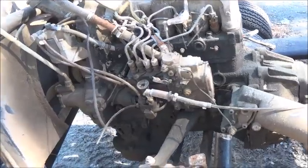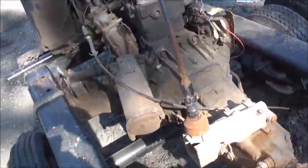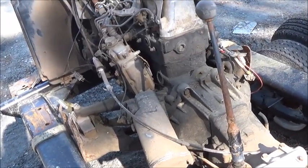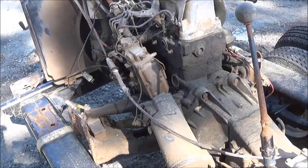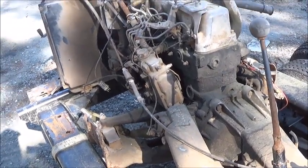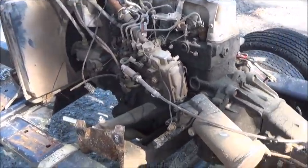We're going to find a used one because you need a governor — when you get into a load and it starts drawing the engine down, you've got to have something to rev it back up. These injector pumps don't have governors in them. Before I pay that kind of money for one, I'll hook a string to it and pull it every time I run a board through. I'm just not going to pay that kind of money — it's crazy. I could find a used power unit cheaper.